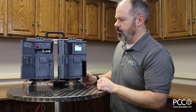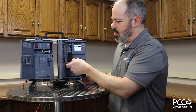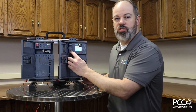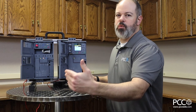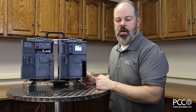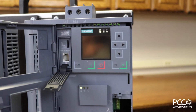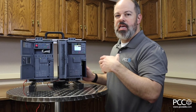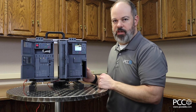Another interesting difference on the advanced HMI is that if I flip this little door down, there's an Ethernet connection on the front so I can connect external software for next-level diagnostics or a software interface to program the soft starter. That's my connectivity right there for configuration. To be clear, even though there are two levels of soft starters — the 52 and the 55 — either of them can have the advanced or the basic HMI; the HMI type is not specific to the soft starter model.